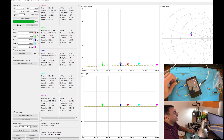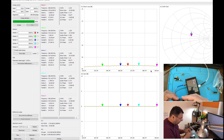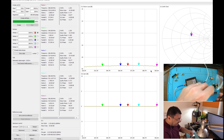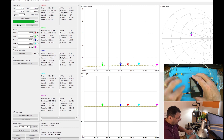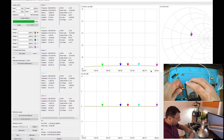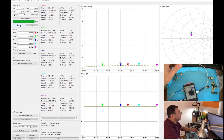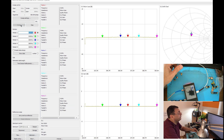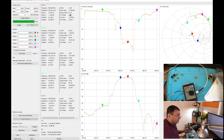Now let's start measuring something. Let me connect a filter here — adapters and more adapters, that makes me crazy but that's how it goes. It's very important to have all these cables in working condition, all adapters checked, because they are very easy to break and mess everything up. We're on calibration one — remember, this is the one where we didn't have a load on port one.